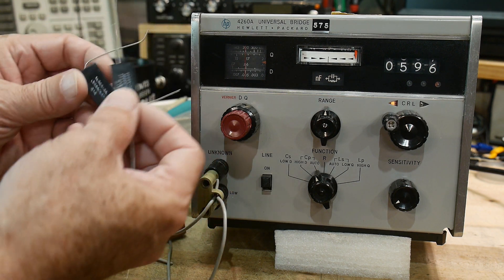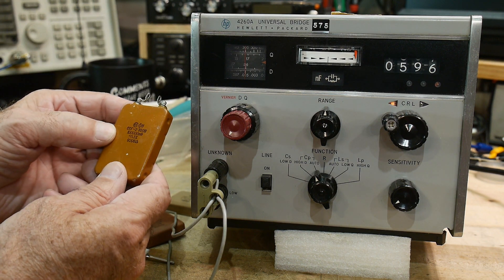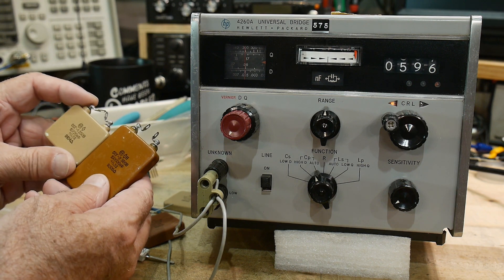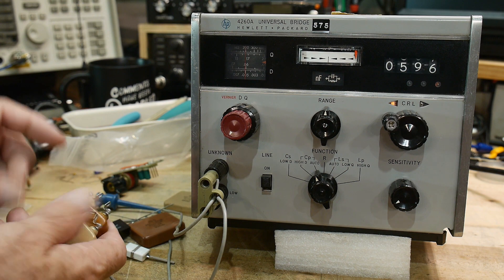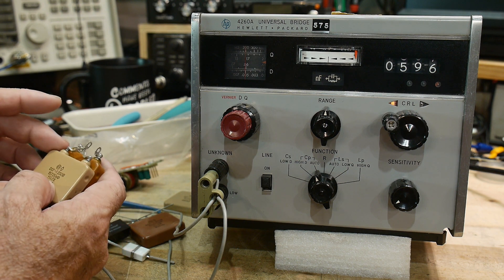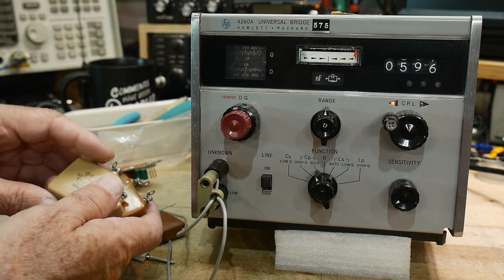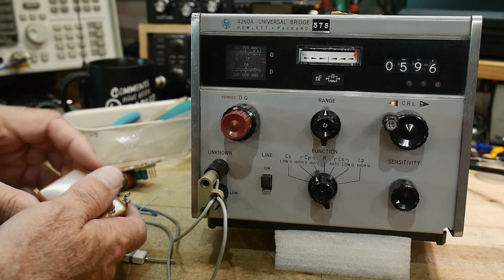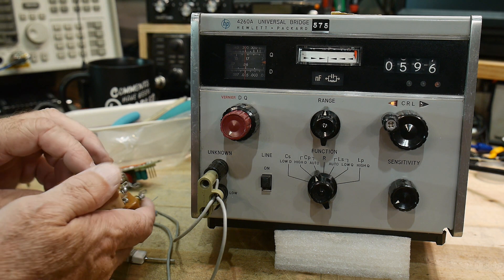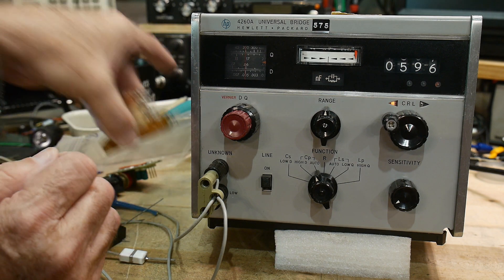These are only 1% capacitors. It's hard to find these 0.3% capacitors. These are Russian. I think these are silver mica — just really, really big. Lots of it. So whenever I see these, I buy them. I've got a pretty good collection: 100,000 picofarads, 15,720 picofarads, same for that one, and 38,470 picofarads. Pretty amazing little things with sealed glass feedthroughs. Military grade. Good stuff.